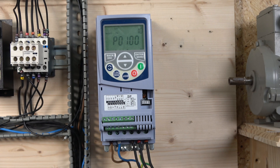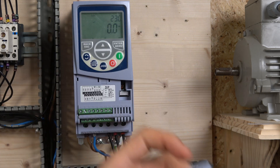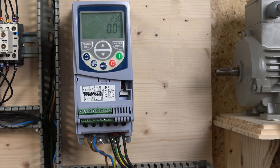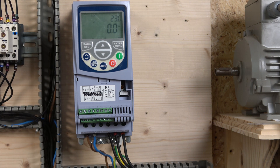We've removed the fan because it was far too noisy for the video — it's on a plug so it's straightforward to take out. There's no internal switch, but for demonstration purposes that's fine. Next, we're going to enter the motor data into the drive. There are a couple of ways to do it; I'd have liked to use auto-tune, but my motor at 0.18 kW is too far from the drive's 1.1 kW rating, so auto-tune won't perform well. We'll do a basic manual motor data entry, which is sufficient for good drive performance.